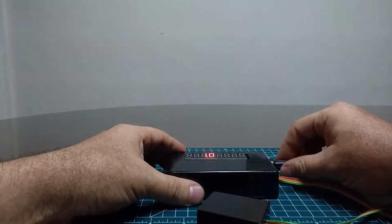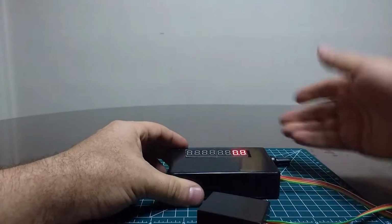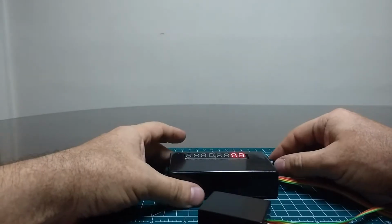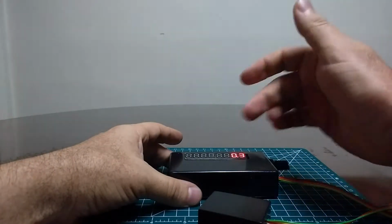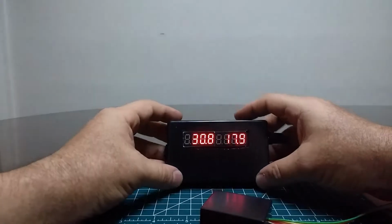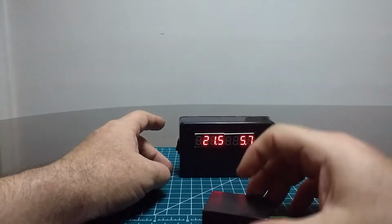If I click this, I can adjust the value of the zeroing for this axis. If I hit it again, I can zero the device for the other axis, so that I can be absolutely certain that it is level. It will also store the offsets for both adjustments that I have made in the internal memory, so that after I power the device off, it will still remember what their offsets were and which is the true horizontal position.